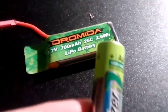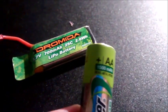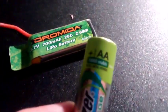What you'll do on some chargers, like RC chargers, which I'll leave a link to a couple examples in the description, what they'll always ask for is the amp rate you want to charge them at. So basically, you'll say 1,500 milliamps divided by 1,000, and that will give you the charge rate. So then it'll be hooked up, and then it'll start charging. Pretty simple. Alright, so that's basically how they work.